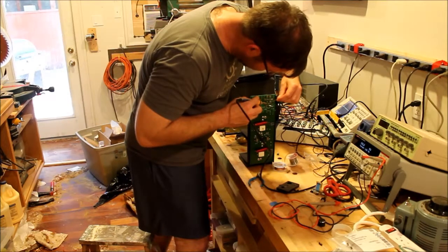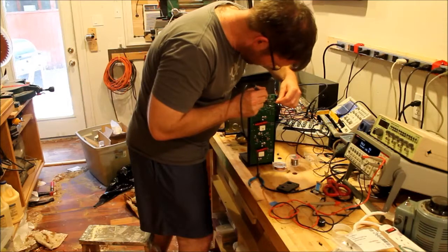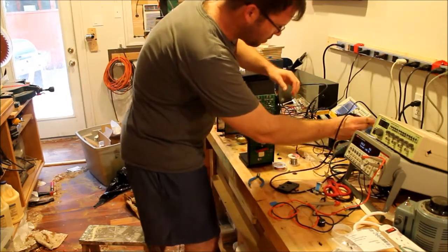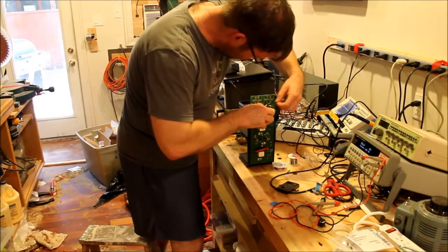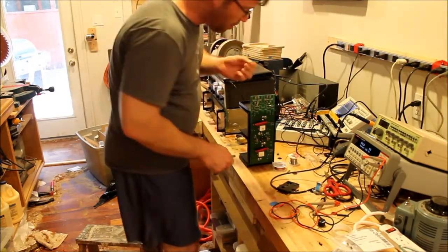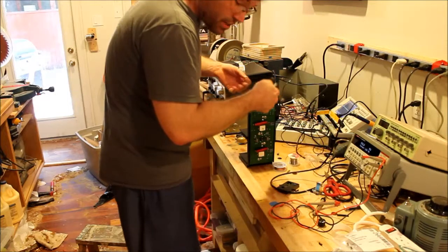solder it back on. A lot of people would freak out about using a solder tip this large. You're just careful about how you angle it in there. And this is something that's important to do. Hold on to those leads when you trim them off, because if they go into that piece of equipment and you don't realize it, that could be a disaster.